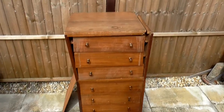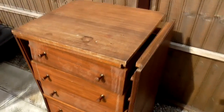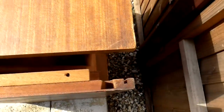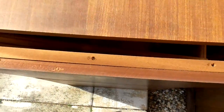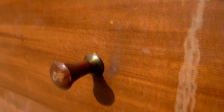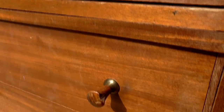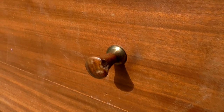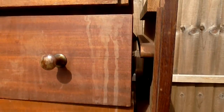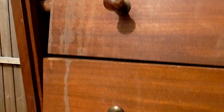This is how I found the drawers. Although it looks really broken, it does actually slot back together quite nicely with these dovetail joints, so I can scrape off all of the old glue and glue it back up. I love these drawer handles — I think if I can sand off the old finish and refinish them they should look quite nice, although one of them is damaged. There are quite a lot of light water stains on the front of the drawers too, but hopefully I should be able to get those off.